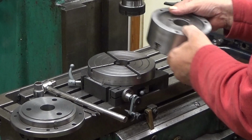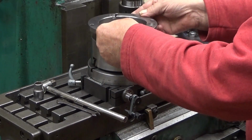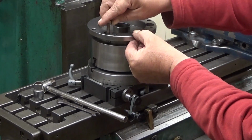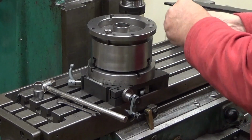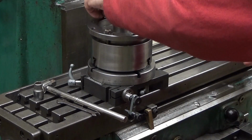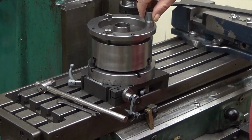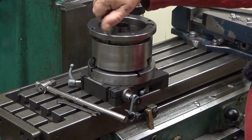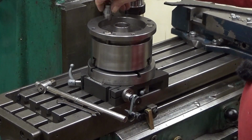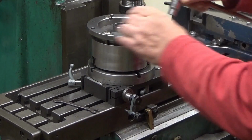So first things first, let's put this here, and then we have the back plate here, which goes here like that, and then we have 3 M8 screws that go somewhere there, like that, and like that. No trouble at all. You have to be a little bit careful when tightening these, so that you tighten them equally, and especially that you don't over torque them. Okay, it's there. And now let's see.